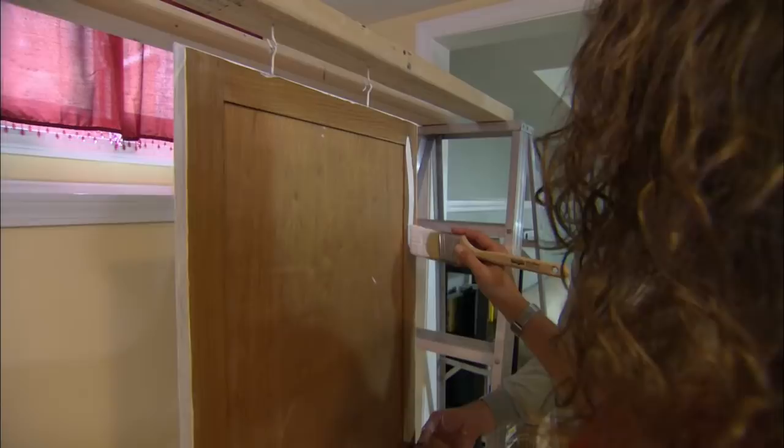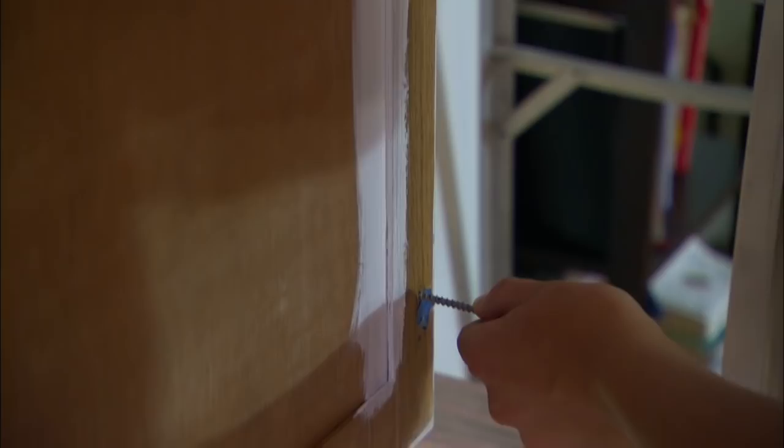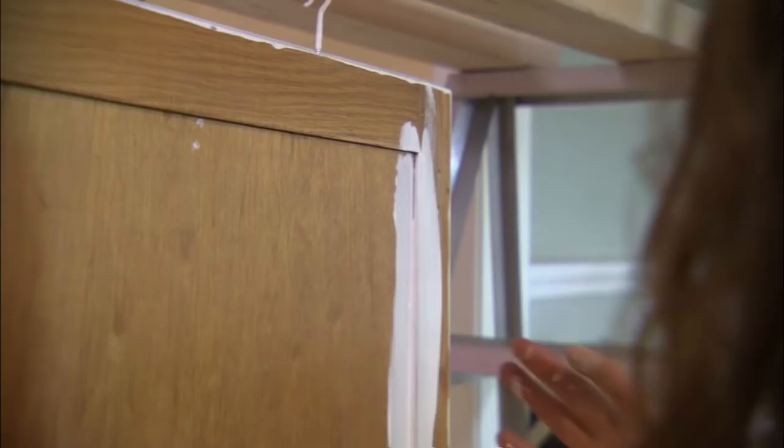There's a little trick: put a screw in one of the screw holes from the hinge, and you can use that as a handle so that the door doesn't swing back and forth while you brush it. You want to paint the back just like the front, painting all around the edges of the panel.